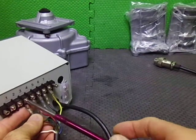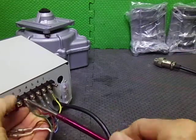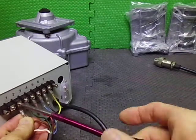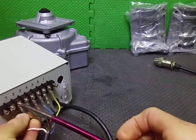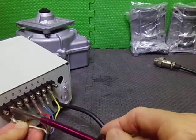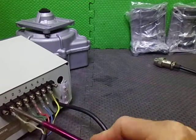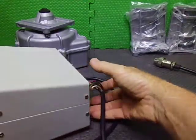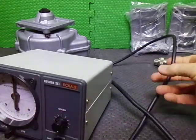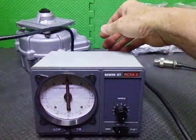The rotator has been fully aligned as well, so it's in pretty good nick now. The motor was the main issue with this one — when I pulled it apart there were wires actually hanging off the windings inside the motor. I definitely think it was a lightning strike that did that; there was actually a lot of damage done to it.